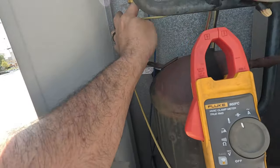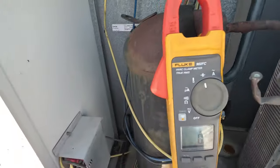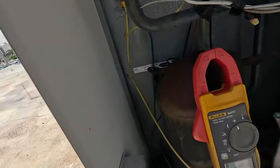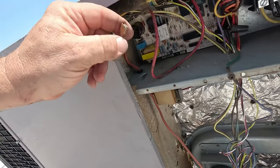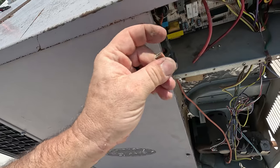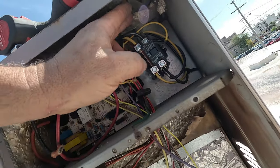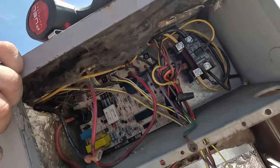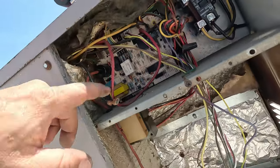There's the yellow wire, jumping as a common on down. Common going to the fan. The other one is a run going straight over to the contactor, which then goes through this little wire hole here. Let's take a look at the contactor — just popped that panel. I see a wire just kind of hanging here. I'm assuming that was an unused fan lead. It's got some insulation, but you don't just let it lay on the metal. The contactor doesn't look too bad so far.